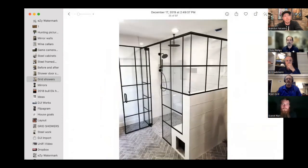So like this one right here. This grid ended up being funky right here because it had to match the channel going up the riser. So we had to have smaller boxes right here, and then everything had to be built off these boxes. We were able to keep it the same everywhere besides in here because of that. But I've seen guys do it where they don't put channel where the door seams are, and they try to make everything even, so they leave channel off in some of the areas of the seams, and it looks weird when you do it that way. Even if it's doubled up and the grids look a little better, I personally think it looks better if you just wrap it and grid it that way, because otherwise you see these extra lines in there and it throws everything off.